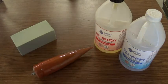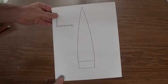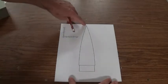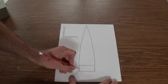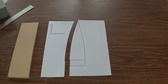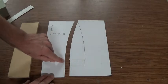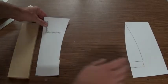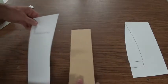I'm starting out with a printout of my nose cone from the OpenRocket software. I just need a profile of the nose cone, so I'm going to cut down along one side and keep going down to the end of the paper. The piece I need to keep — and that needs to be cut out perfectly, especially down in this little nook area — is this piece, not that one. Here I've got a piece of half-inch MDF material.